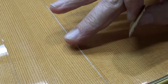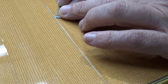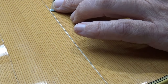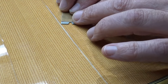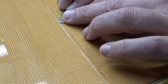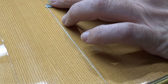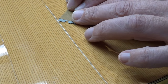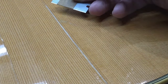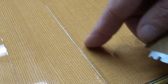As you can see here, it's a little tall — it's flush here, but it's a little tall on either end. Ian Davlin taught me to come in with a razor blade with a piece of tape wrapped around it and start making little slices. You don't want to do it all in one pass — you want to do it little by little. Take your time cutting through the spline. Now I've got to get it back out, put the epoxy in, mix it up, and stick it back in.